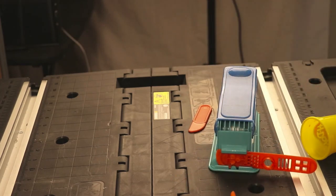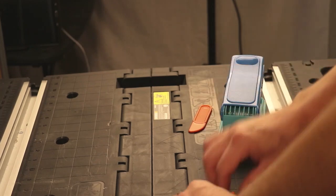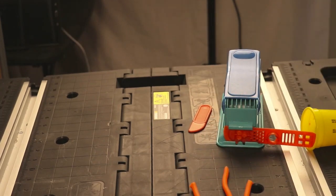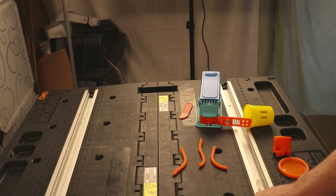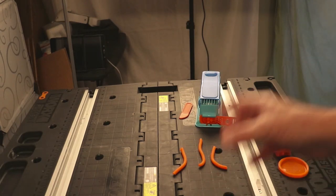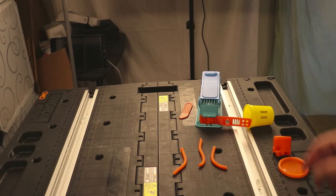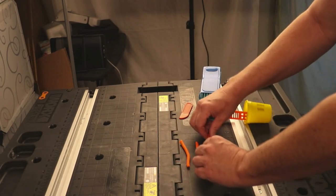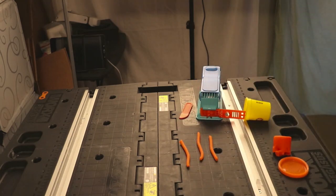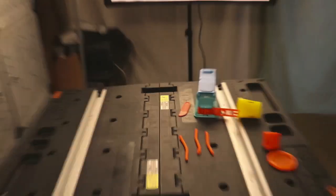so you have a 0.4 nozzle and you tell it that you want to print in 0.2 millimeters, right? So 0.2 millimeters is not exactly the full width. You know that this comes as 1.75 millimeters and then we squeeze it down to 0.4 millimeters, but that's on the sides. So each one of these, when it's being printed, isn't printed straight up. Let me zoom in a little bit here.